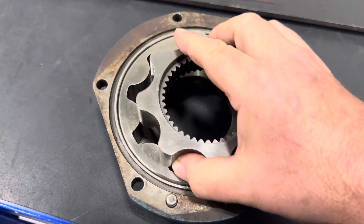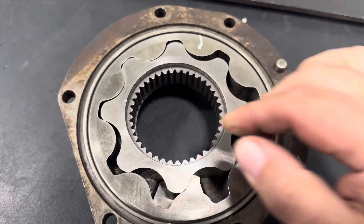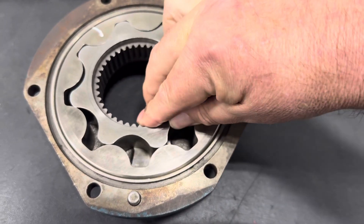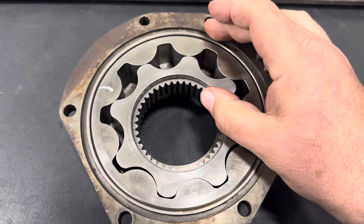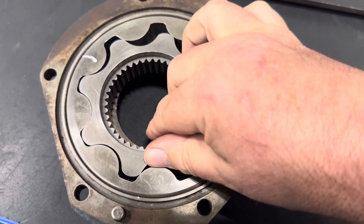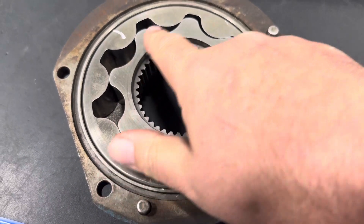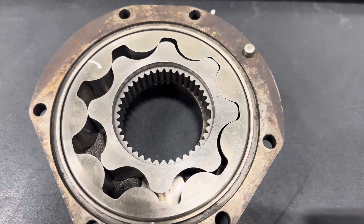There's another test — I'm not sure if International lists it in their service manual, but Cummins does and they call it tip clearance. These are your actual pumping chambers. As the gear set rotates, the oil clearance changes — it forms a large space that draws oil in, and as it rotates that space decreases and forces oil out the outlet. Tip clearance measures the space between the gear tips that separates the pumping chambers, because that gap can start to leak by as it wears.